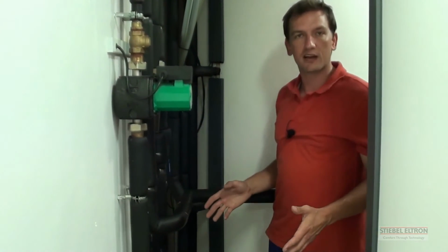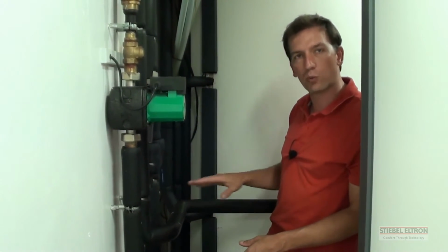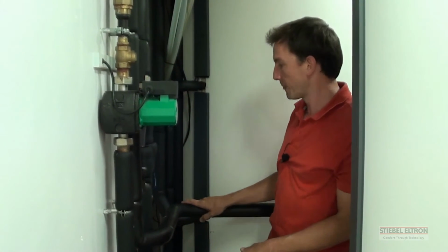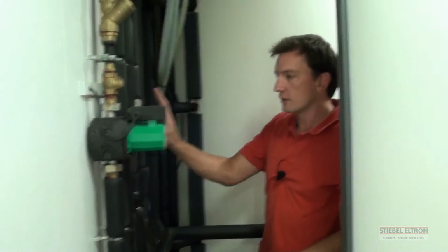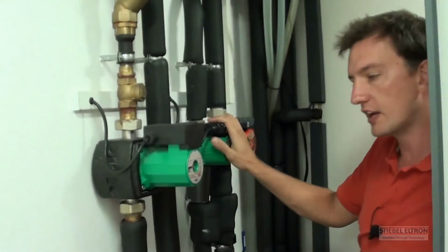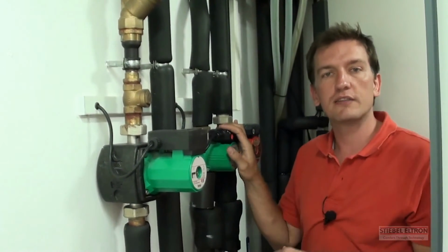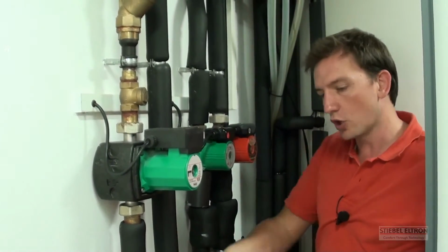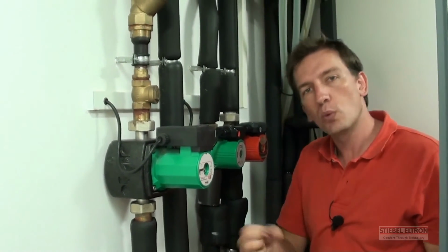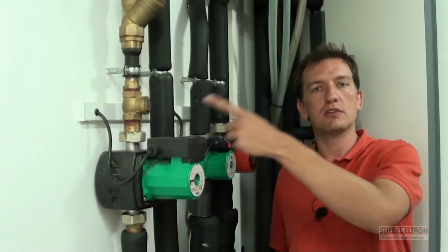It is basic science, and it's this basic principle of water layering that we are unable to marry these two systems. The extra pumps and things that you see inside here, this is fancy because on this house what they wanted was a hot water ring main, so that the minute you open your tap anywhere in the house, you've got instant hot water. You don't have to wait for the water to get from this side of the house to that side.